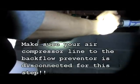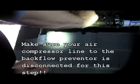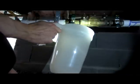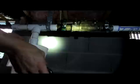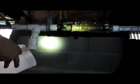So leaving this valve closed, what we're going to do is open this valve here. So right now these are closed. These are perpendicular to the pipe. If they're open, they're going to be parallel or in line with the pipe. This is our drain here. So this is where our water pitcher is going to come in handy. We're going to use the wrench to basically just open this drain cap, catch all the water with our pitcher, and then we can throw that out.